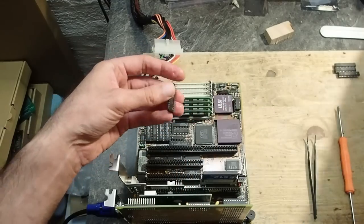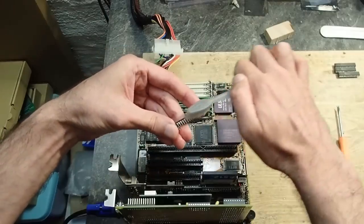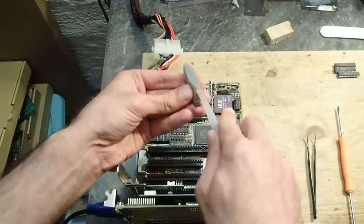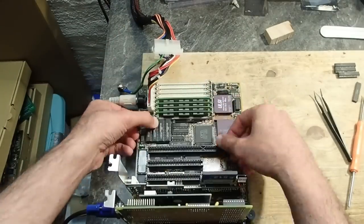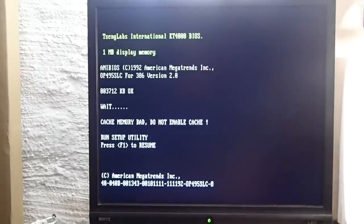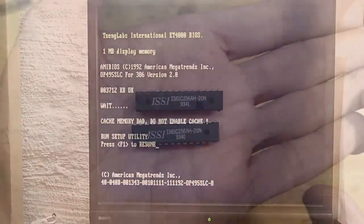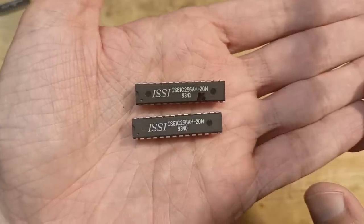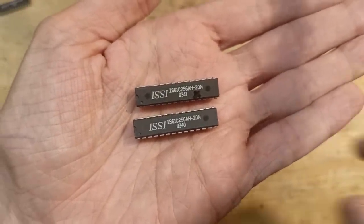As I said, one of the sockets was slightly corroded and maybe there is still some corrosion on the pins of the IC. Nope, this chip is definitely bad. I looked into my spare parts and found the same SRAM IC. And funny enough, they were made at almost the same date.